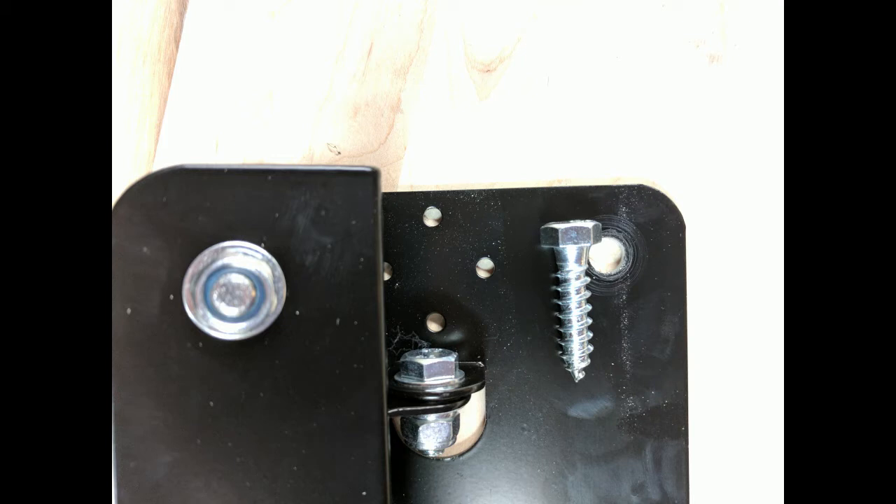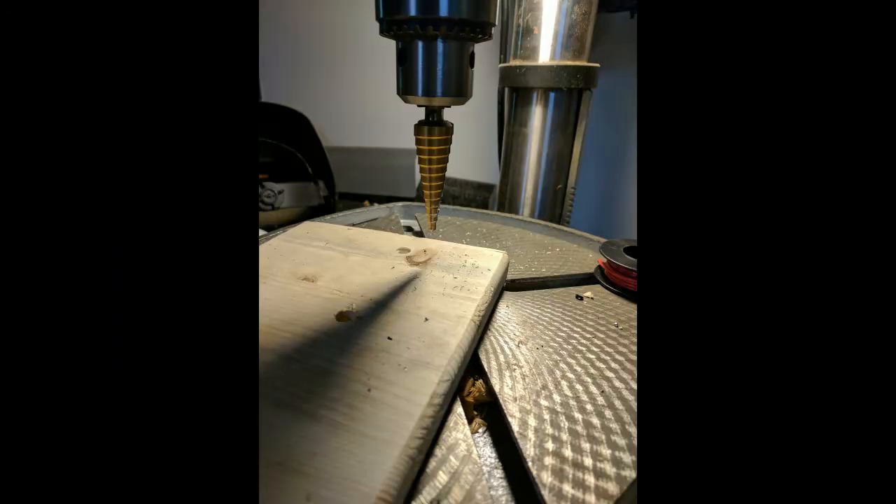The first thing is I got a lag screw. If you look at this photo, that's the mounting hole in the bracket as it is. I got lag screws where there's a bit with no thread — that's just about the right size. This is called a step drill — it's a really easy way to take a hole and turn it into a bigger hole, and you're really going to need a step drill to do this. What I had to do was take the mounting hole out one more step, just slightly bigger.